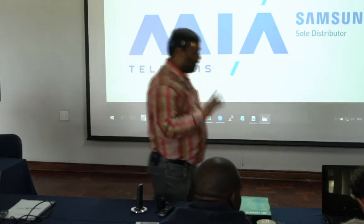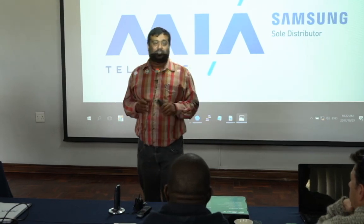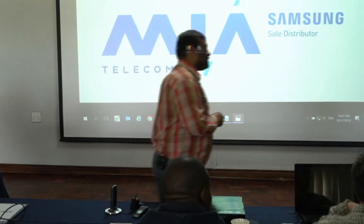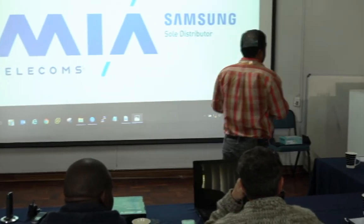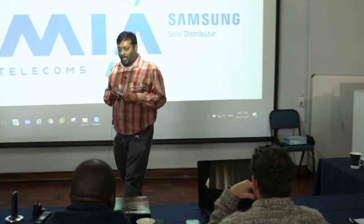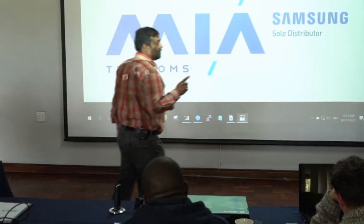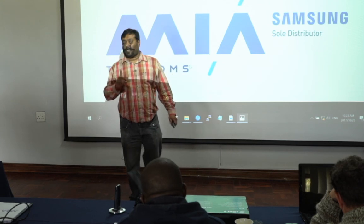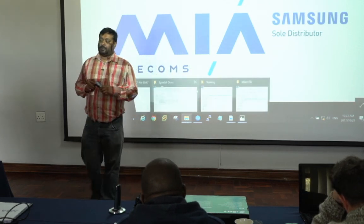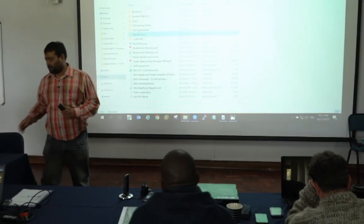No, I'm getting to that now. Okay, the base station does not work on PoE. So you have to plug power into it, LAN cable into your switch, and we're up and running. That's as easy as the installation gets. All right. Yes. No, repeater can't repeat. So the repeater has to connect back to the base station, yes. Okay. Yes, five concurrent calls. Yes, we can go 20 handsets, but 5 concurrent calls only. So 5 concurrent calls in between the handsets? Yes. Because remember, it has to go through the base.